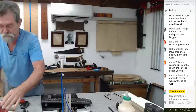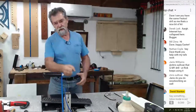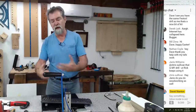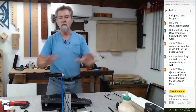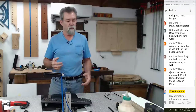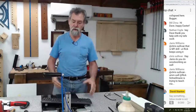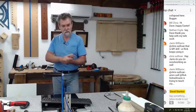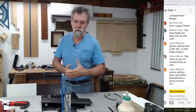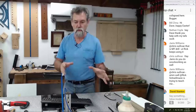And why am I doing that? The front of the drawers are the areas where you're going to be dragging tins of stuff out. You know, they're going to get all the punishment. The sides and the back of the drawer are not going to get damaged at all. So when I'm putting iron-on edge strip, I try not to put that on the drawer front. We don't want to put an actual drawer front in front of the drawer. Two different things, drawer front and the front of the drawer. Because we're going to lose capacity of this drawer and we want to maximize what we can get in there.